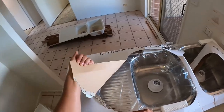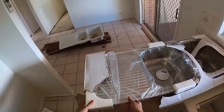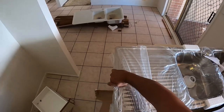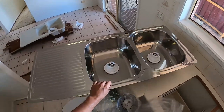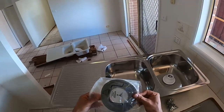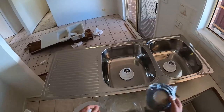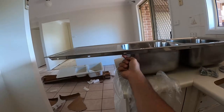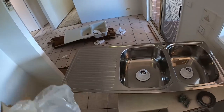So now it's time to open up our new kitchen sink. This one might be a little bit different in terms of the fixings — usually they still come with double sided tape and we might also have a different form of fixing with screws. We've got here a set of brackets which we may or may not need depending on the position once we drop everything in place, and we've also got our double sided tape. Generally speaking double sided tape is sufficient on its own — we'll see how we go with the brackets. With these ones you can either install the brackets and clamp them to the sides, or depending on the position once we drop it in, we might be able to directly drive a screw straight through the side and into the actual kitchen bench.